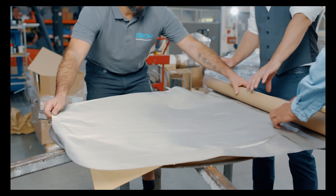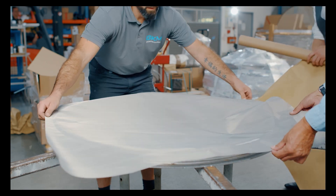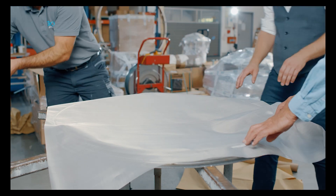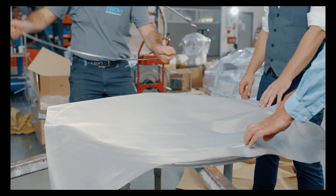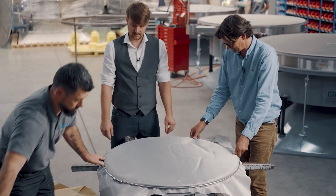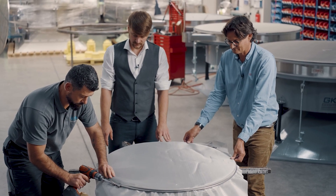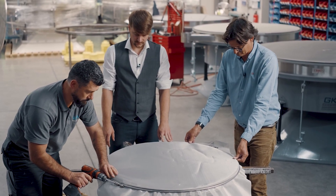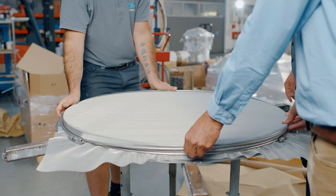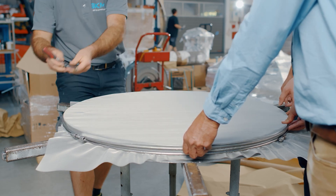So we do have a mesh cloth with 120 micron in this case. Please put the mesh cloth on the existing ring. This ring is slightly larger in diameter than the ring you are using for your screening machine. For example, you have an 800 millimeter diameter screen on your screening machine. In this case you can use an outer ring with a diameter of one meter or even better 1 meter 20. You can then fix the mesh cloth with these two clamping rings to get the tension.